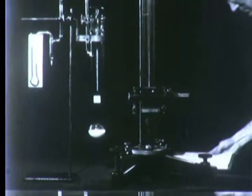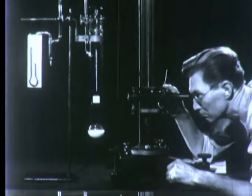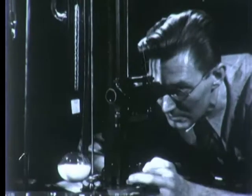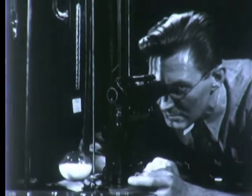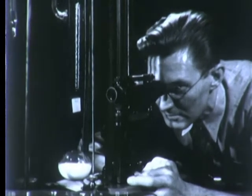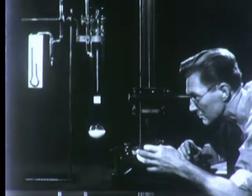For instance, here is a case in which a quartz spring is being used to study the weight change of a sample of a new insulating material under the influence of a moist, corrosive atmosphere. The varying elongation or stretch of the spring with change in weight is measured with a special telescope device.